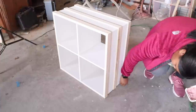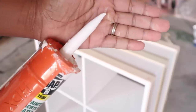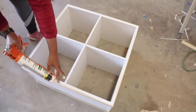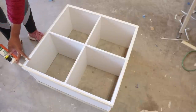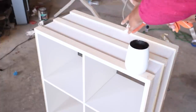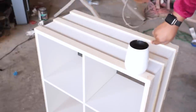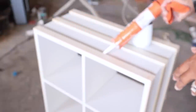After filling in the nail holes, the next step was caulking. Cut the tip of the caulk tube at an angle, then slide it down all the areas that need caulking. Put a little water on your finger and smooth it down — it's a really nice way to give your piece a clean finish and make sure there are no gaps between the wood and the organizer.